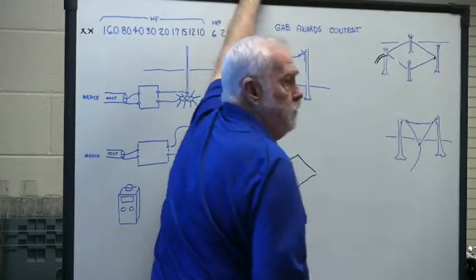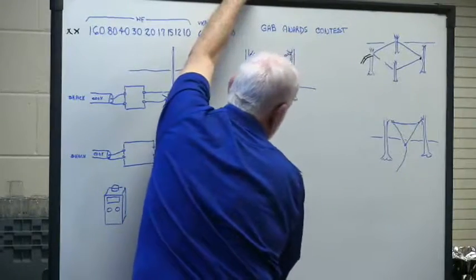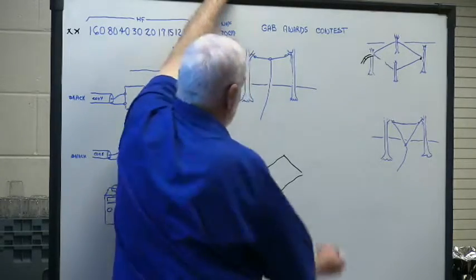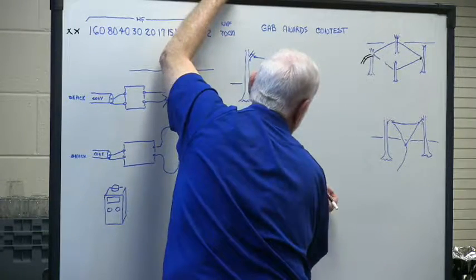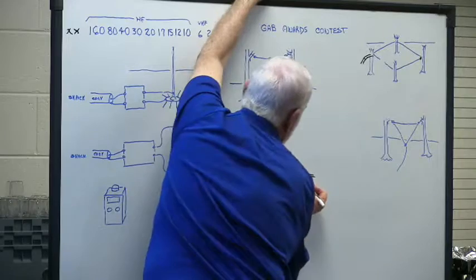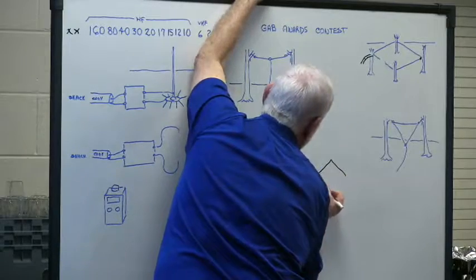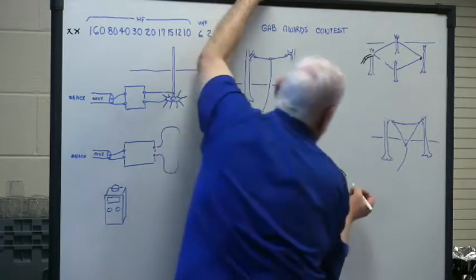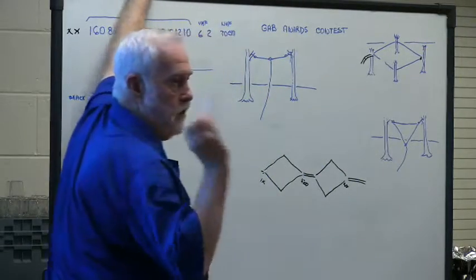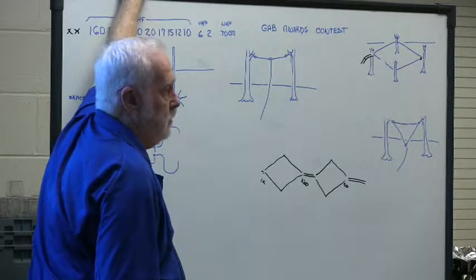What they had was a rhombic with about 8 or 9 dB gain, probably closer to 12. You feed it here, and you've got to dissipate half the power there using a carbon resistor. With the phasing correctly, let's say they put a kilowatt in here, they'd have to get rid of 500 watts here. They feed it into another rhombic, and they have to dissipate 250 watts here. They carried it down. You can see rhombics as far as the eye can see. The gain on that thing was unbelievable. They never had an outage.